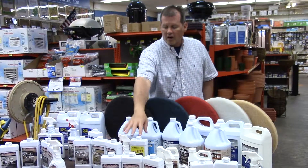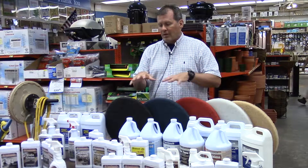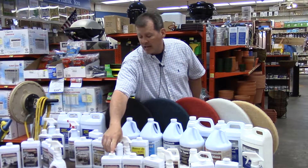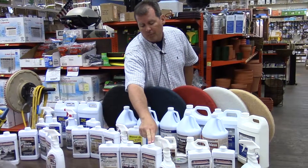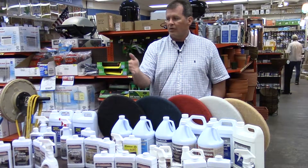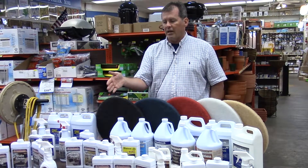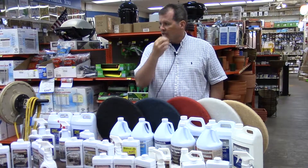For resilient flooring — linoleum, asphalt tiles, checkerboard patterns — it's the exact same type of product. You can remove any wax that's on it, clean the floor really well with a concentrated cleaner, and then apply Super Gloss. We have three products: All Wax, Acrylic, and Super Gloss — very similar to low grade, mid grade, and premium gas. It's about solids content — a lower percentage, a mid amount, and then Super Gloss at the highest percentage. The price point reflects that, and Super Gloss gives you the best bang for your dollar in coverage, durability, and sustainability.